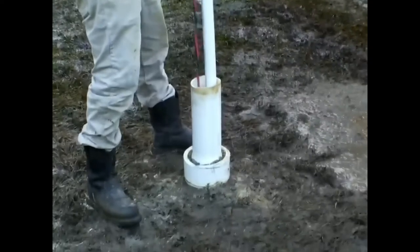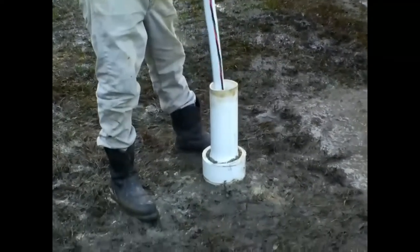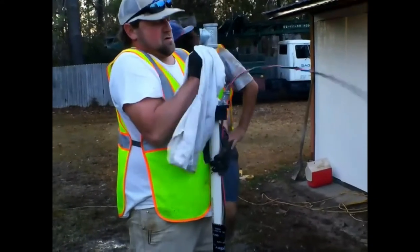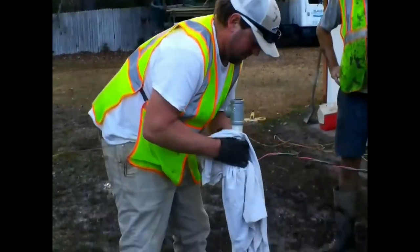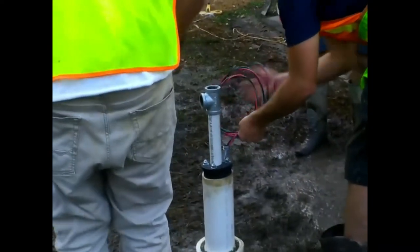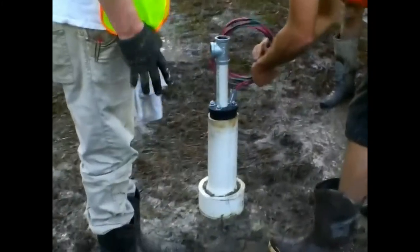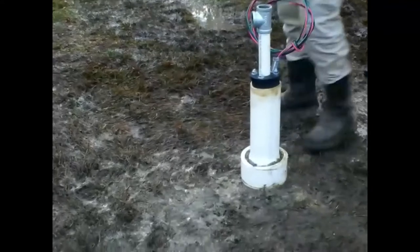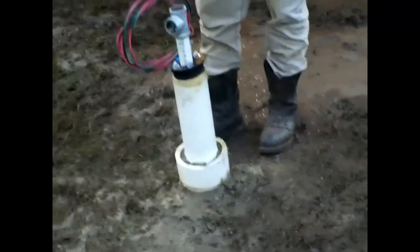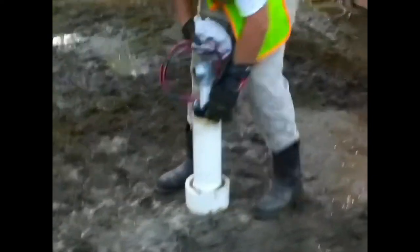There's our water table — now the pump's going below the water. There's another 30 feet or so. We're discussing which side to position the bladder tank, making sure the discharge valve faces the right direction and the hand pump will be facing out properly. The water runoff should slope away properly too.